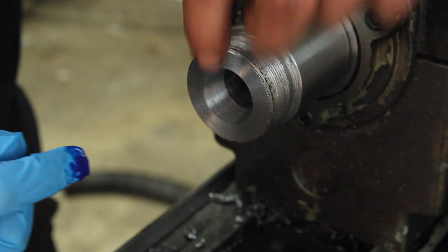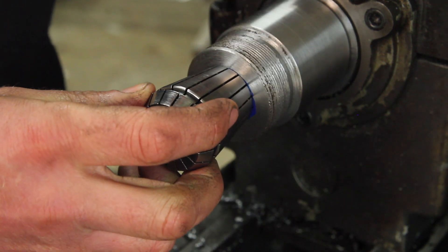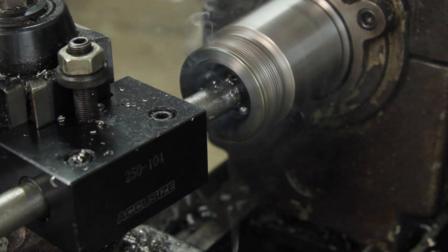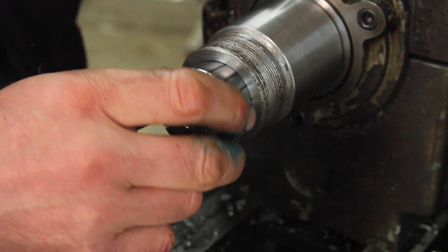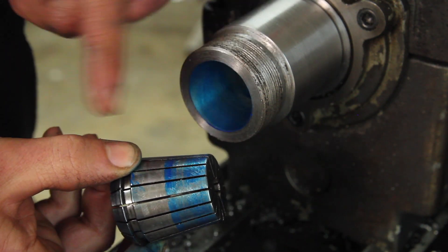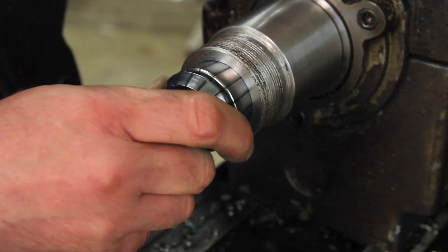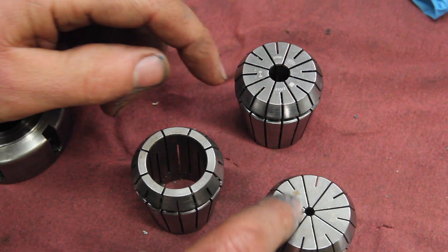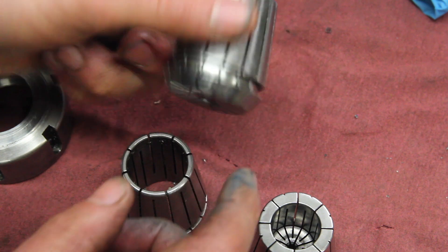If all you can do is set the compound, you can take a little bit of blue and blue this up, and then very gently without deforming the collet, test it. I'm getting in about halfway now and I've still got pretty reasonable coverage the whole way up. I might have just gotten lucky on this. I like to pick the smallest collet that has a solid back all the way back, because I think that gives you a little bit more resistance to deforming it when you're putting it in.